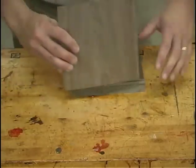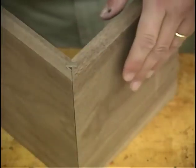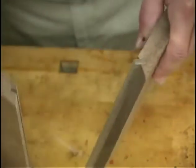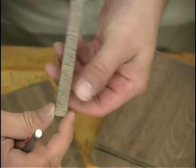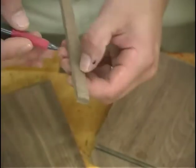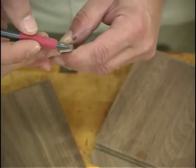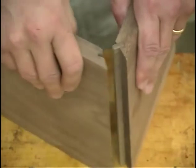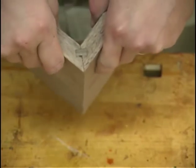It took about three attempts and now we're going to see how well everything fits together. So far so good — it fits up real tight. Now one thing I'd like to point out is the spline itself. We can machine the slot relatively easily, but the spline — notice the grain direction, it's running this way. This is actually a very short cutoff piece. When you cut them to length, make sure that you don't make them too long, because that will prevent the miter joint from coming together if the spline is too long. So take your time and make sure you make your splines just right.